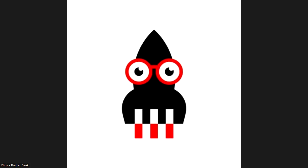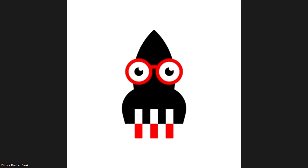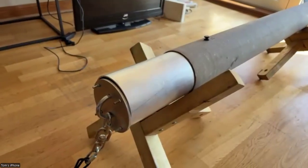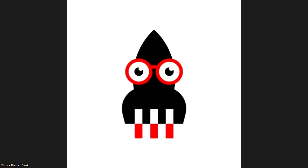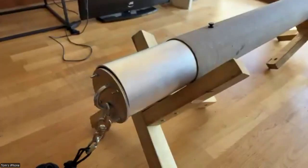Your trade-off there is how much material is between the edge of the tube and your hole. If you do a single row of 8, you can split the difference and get the maximum distance between the edges. If you do 2 rows, then you get closer to one edge or the other. We're not trying to tell you to do it one way or the other, it's just a trade-off. It's your decision. I'm just curious what you were thinking.